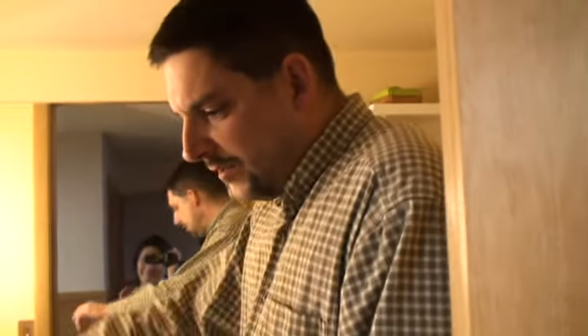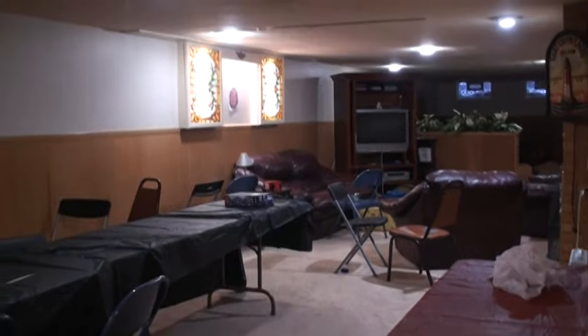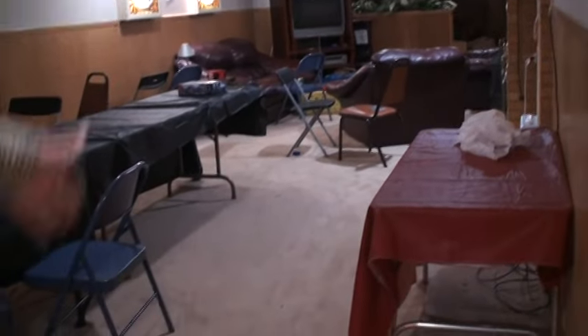In a big room, you want to measure your lines first. Like if I was to do this whole basement, I'd have to run a string line all the way down the middle, make sure it's perfectly in the middle — measure it from the walls or whatever. But in a small room, you still have to worry about that. Because you don't want to start tiles even on the walls — you don't want to start tiles on the top or the bottom, because the walls aren't perfectly straight. So you always want to start in the middle.